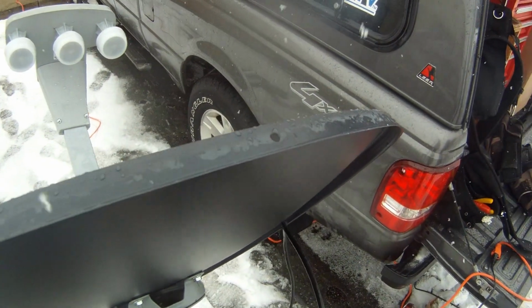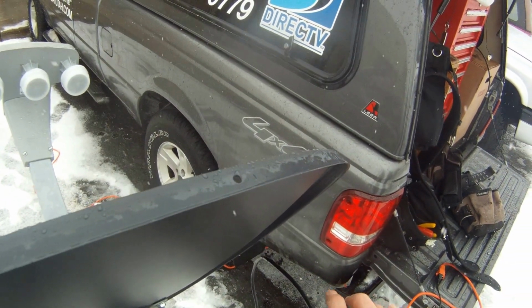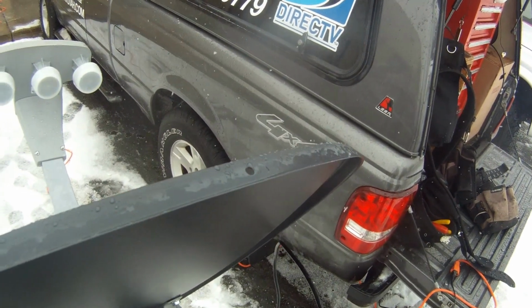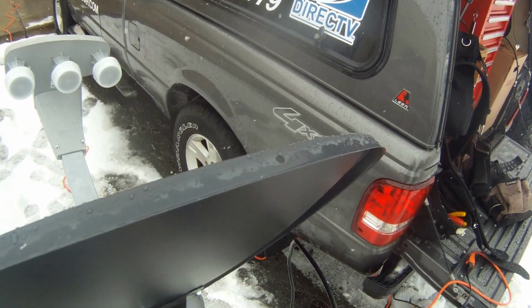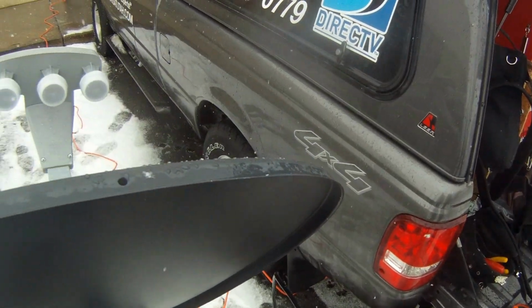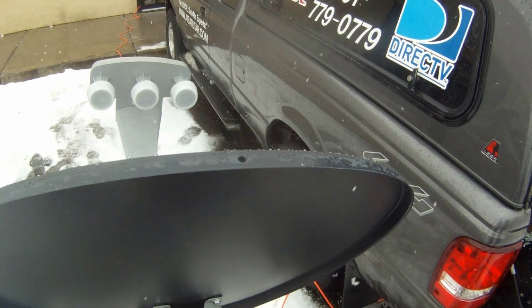And on the Super Sat Buddy, let me just show you, you power it on, and if you need to go to Dish Network here in Utah, you select enter. We're at Western Arc 1000.2, you select that. That's all we're pointing at, and you're done. It's going to take just a second to start calibrating the LNB and so forth.